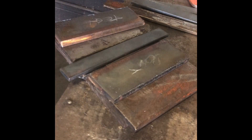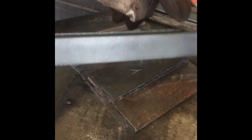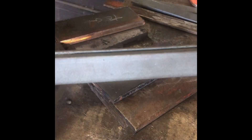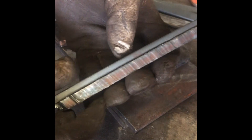So we just got back — you just got done welding your coupon. You went over to the plasma cutter and cut your bevels off on each side, nice and smooth like that. This is not going to be able to fit back into the orange jig, the regular jig we just did — it's going to be too thick now that we have this metal welded on there.